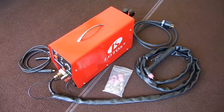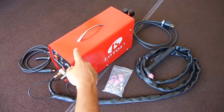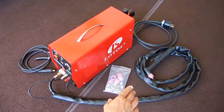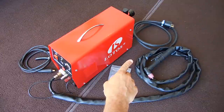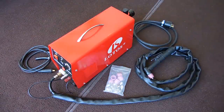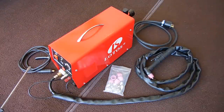This unit was cleaned up — it was not as nice as you see here. The screws were all rusted out, the handle was missing. I cleaned up all the hoses, took apart the gun to make sure it was all clean. It was missing a plug on the end, so I added the 120 volt plug. I also took apart the regulator, cleaned it, painted it, swapped out some parts including the gauge and the vinyl hose supplying air to the unit.